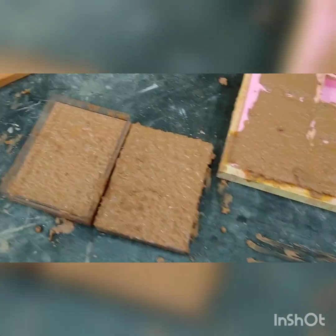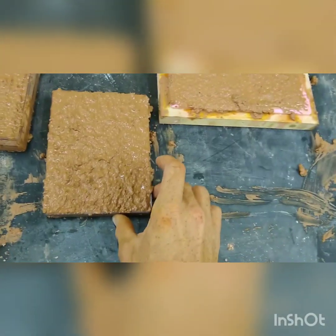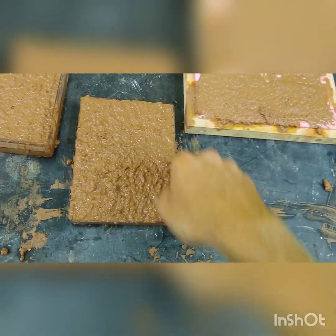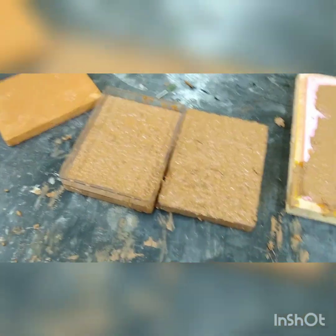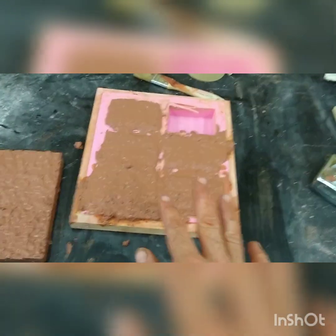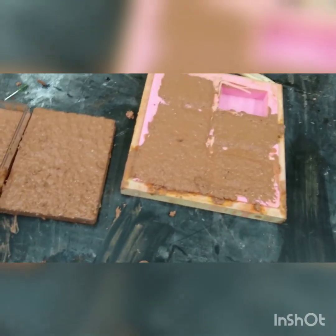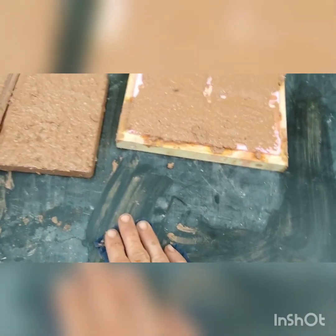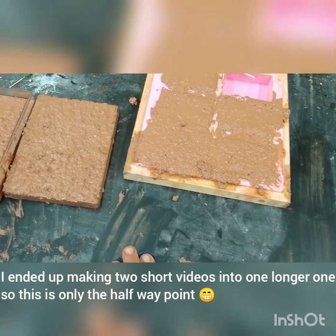I have the molds poured — you can see it's pretty messy. With the small silicone ones, I fill it right to the top. With the bigger one, I fill to the same height. And these I overfill — I fill them past the fill line, and then right as they start to set, I'll come with a wide putty knife and scrape them smooth. That's the best method I've found for getting clean blocks.